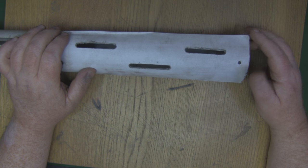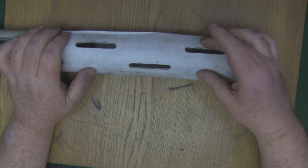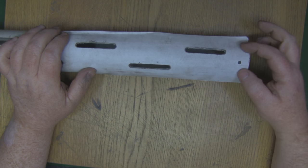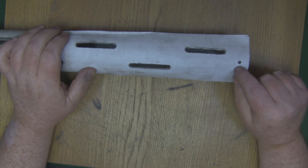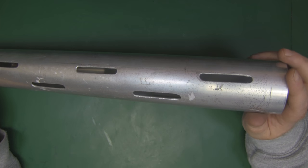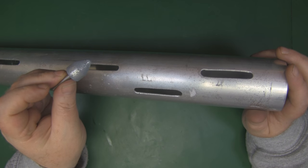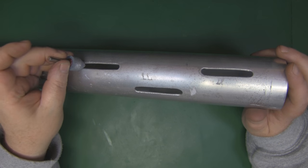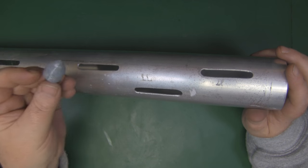I've got all the slots cut out with the cutting wheel on the dremel. Now I'll get in with a small hand file to tidy them up, removing the template so I can see better. Before doing that, I'm drilling a small two millimeter hole where the main driven element is going to go. I also found this little grinding tool useful — got a pack from the pound shop — it's great for getting in and filing the edges down inside the slot itself.